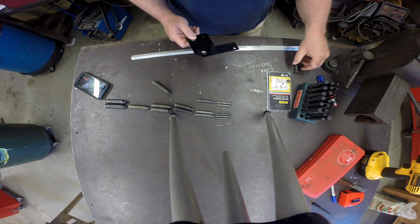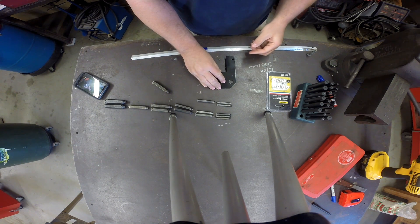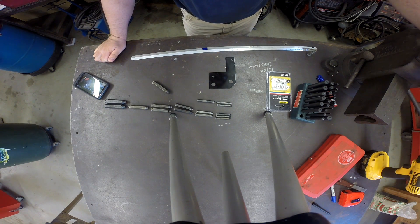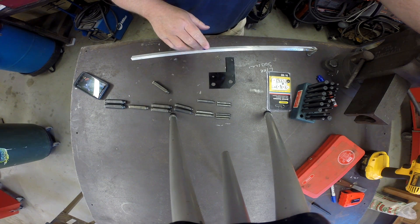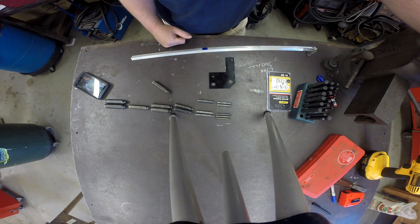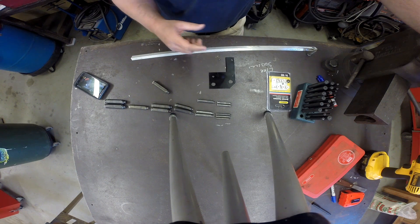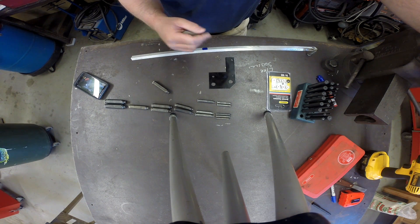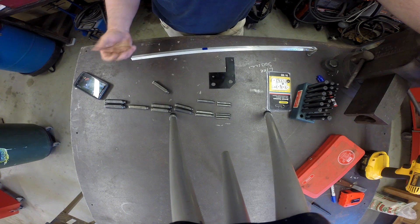Something else I've done in the past: I had a project where we were putting aluminum tread plate on a wrecker bed — back in the days when everybody thought aluminum tread plate looked great. There were some bolts we couldn't get out and didn't want to, we just wanted to put the tread plate right on top and drill a clearance hole for each bolt to pass through. They were button head bolts using an Allen head screw to remove them. So what we did was take an Allen wrench, sharpen the end of it, cut it off, place that into the female part of the button head, and use it as a transfer punch. That's something to think about as well.